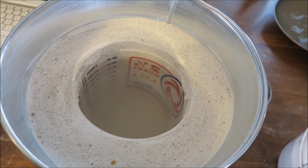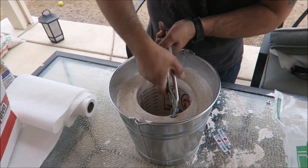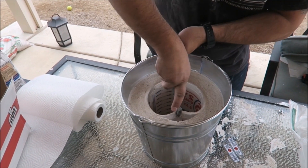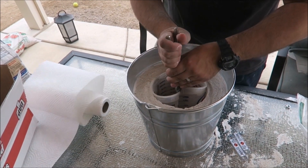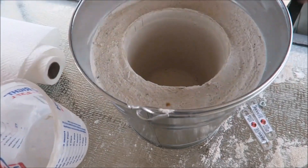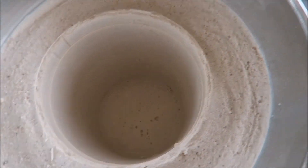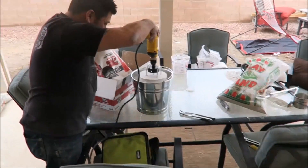Now back to the foundry. Now that it's cured and dried, we're going to look at the center. Take some channel locks or pliers, pull towards the center, then twist until it pops out. It's very easy and comes out smoothly. Then all you do is clean out the center of your foundry and get it ready for the placement of your crucible.